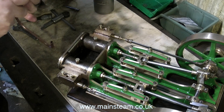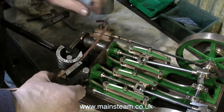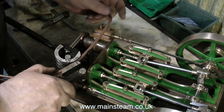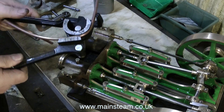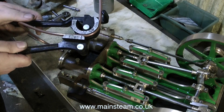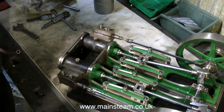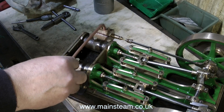While the Kilrock K in the pickle bath is doing its stuff and cleaning up the copper parts, it's time to have a look at making an inlet for the steam, because this is completely missing. I'm going to make it out of a piece of quarter-inch diameter copper pipe, and I'm bending it here using a commercial pipe bender — very simple. The length of it is unimportant, because it's going to be cut in the middle and silver-soldered to a T-piece.